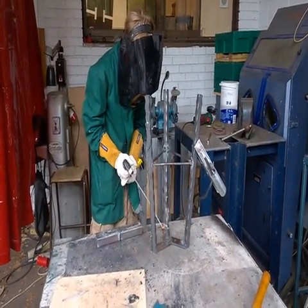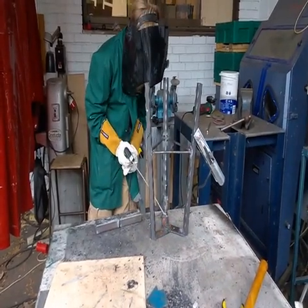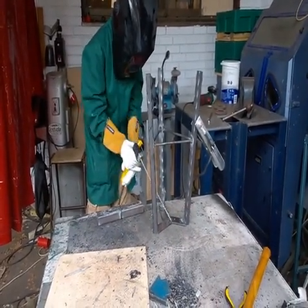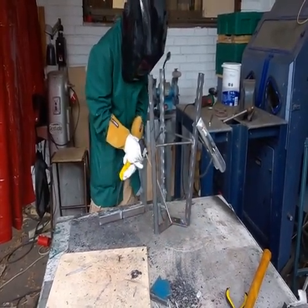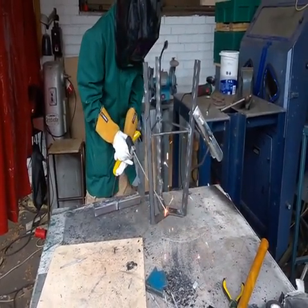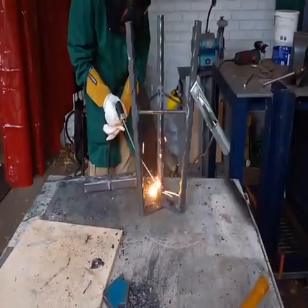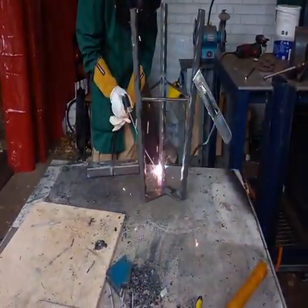Remember, when it's a new rod, sparkle it a little bit, it gets rid of the glaze on the end and it warms it up. Okay. Come off. Sparkle it quite a bit there in the middle. Lots of sparkles. Slower sparkling, but sparkling nonetheless. Do loads of them like that, yep. Okay, do you think it's going nicely now? I think it's going nicely. You can tell how it's going by listening to the sound.